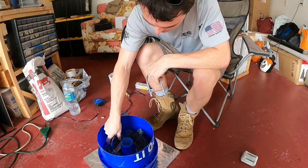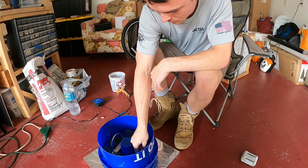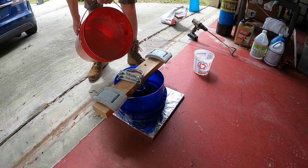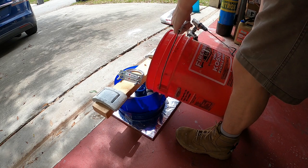When adding the water, I would suggest pouring half to three quarters of the total into the bucket and mixing it thoroughly. When I made the lid I added too much water and there was a half inch layer of water sitting on top of the mold, which may have been why my lid cracked so quickly.